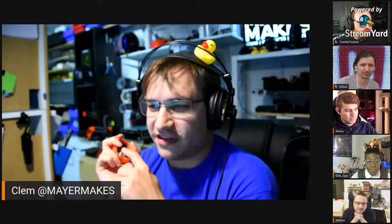I've made a custom PCB for that, of course, to get all the electronics inside this little thing. And it's powered by an ESP32S2. So I'm finally joining the ESP ranks. Like Bitluni's a pro with all that stuff, and I have no clue about it. So I finally joined the club. But I use the S2 because I tried interfacing USB UART chips to the 8266 and another 32, and I couldn't get it to work. And this thing has native USB, and it's USB-C.